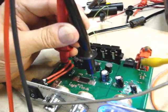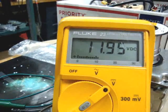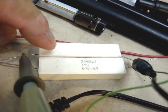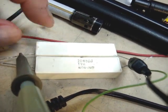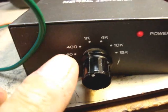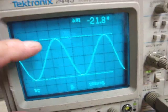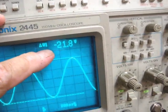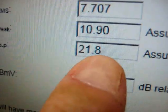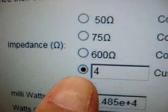Here I'm testing the amp now. Checking the voltage under load — it's 11.95 volts, virtually 12 volts. Two 8-ohm resistors in parallel give a 4-ohm load connected to the amp, driven by a 1 kilohertz oscillator. On the scope we see 21.8 volts peak to peak into 4 ohms.